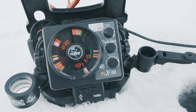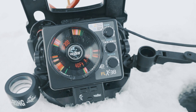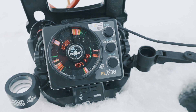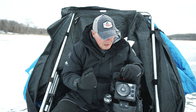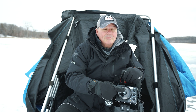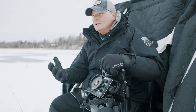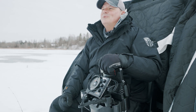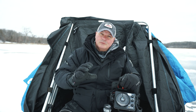On the right-hand side of your screen, you would see the entire water column, and on the left-hand side of your screen, you'd see a zoomed-in enhanced image of just the bottom six feet or the bottom 12 feet, depending on what you set it at. Now with the Verimax control knob, you have adjustable one-foot zoom increments. So if you want to look at the bottom seven feet or the bottom 10 feet, those range anywhere from six feet all the way to 18 feet — that's your zoom window.